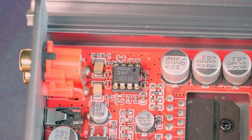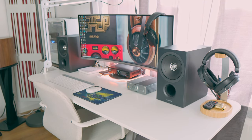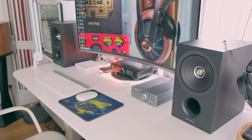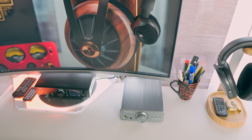So in the end I can definitely say that the upgrade to at least the V5i op-amp is a must-have. The standard op-amp in my opinion has muddy voices, no definition, with bass that is too loose without control. V5i op-amp: night and day difference. Regarding speakers, I was sorry not to be able to drive the C600 from Technics — it really could have been the perfect solution for me. But take this into account: do not pair it with a low-sensitivity speaker and you will not have any problem. It's a really unique and interesting solution that will bring class A and class AB amplification to your desktop. I don't know how many products can do something like that in such a compact size, so take it into consideration.